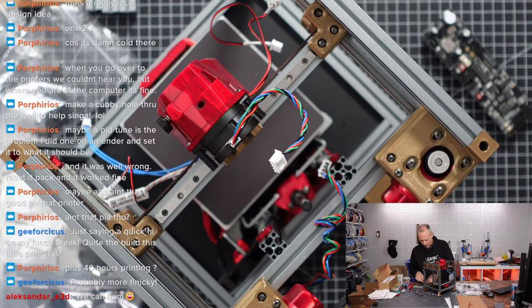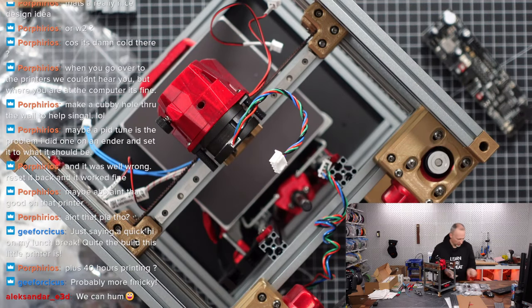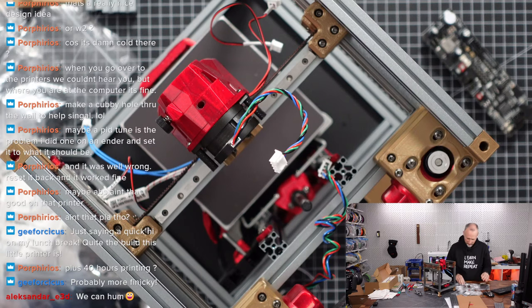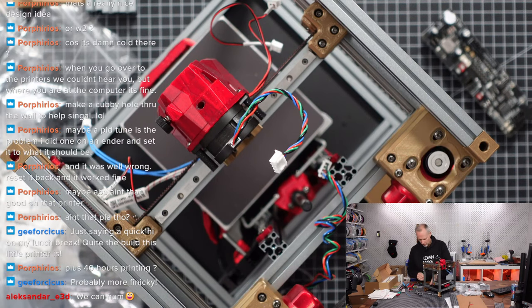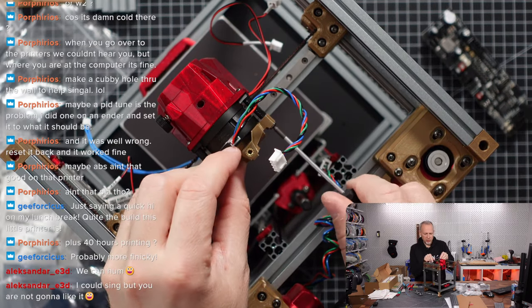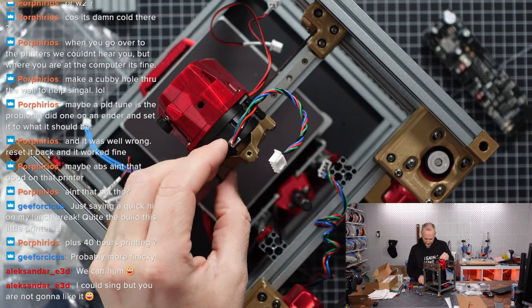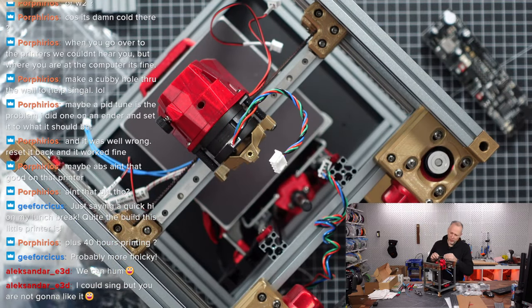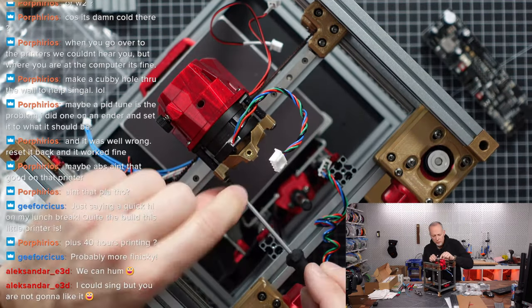We probably need a little bit longer M3x10. Why that is in the manual, I don't get it honestly. Why are they mentioning these if they are too short? Let's see if the longer 10 millimeters work. Yeah, that's much better. At least we grab the thread of that strain relief.